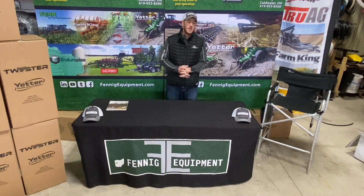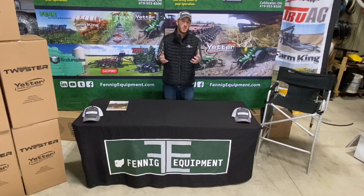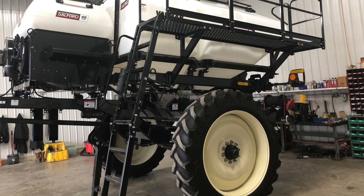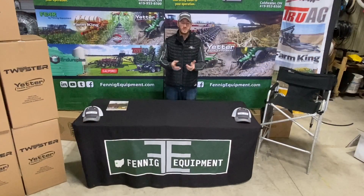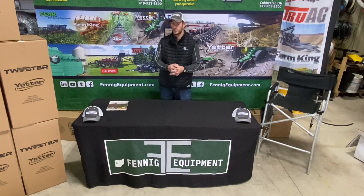From there, we're going to go into the fertilizer application side of strip tillage and talk about incorporating fertilizer with strip tillage or doing a fertilizer banding process. Salford makes fertilizer pull-type dry carts. We can simply hook those either behind your strip till tool bar or they can also be mounted onto your tool bar. They're made in four ton up to 12 ton with single or dual bin, section control, twin bin, prescription capable. These things can put out loads of fertilizer and also get you down to micronutrient levels as well. So blending those with a strip till scenario is extremely easy to do.